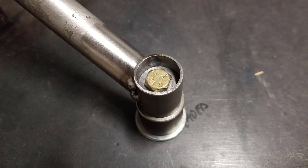They use very hot ovens for that. And my powder coater said he's seen tubes burst in there that just don't have any way to handle the pressures. So especially on thin wall, you want to make sure that you've got your vent holes in there. And that's about it.